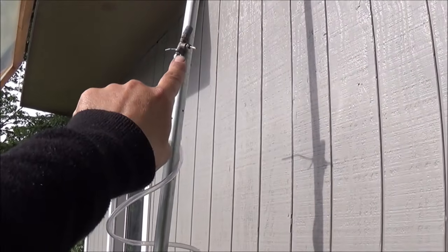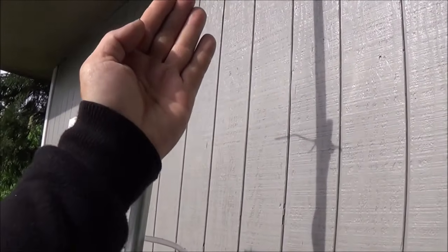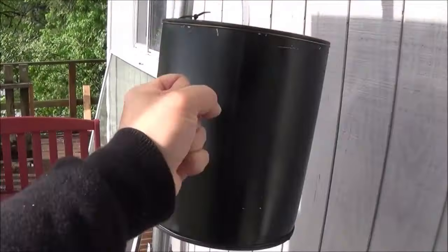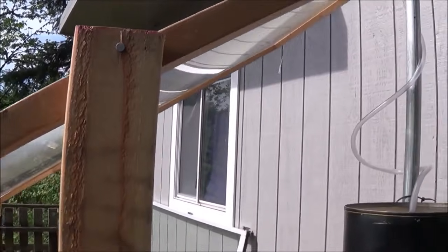Making sure that all the direction of flow due to the pressure has to go one direction — that's up this tube, which has a one-way valve at the top of it. That one-way valve once again only opens in this direction, allowing water to flow out. But then once the vacuum is generated, the vacuum is going to close that valve and allow the vacuum to draw only in this direction.